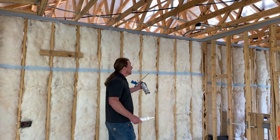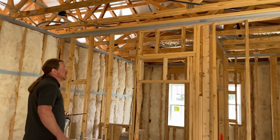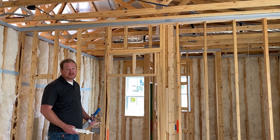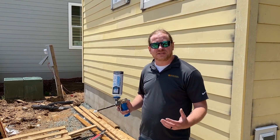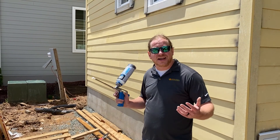The other important thing to remember is that we have to do all of our walls when we're below attic space — interior walls count too. We want to make sure that we do both sides of our interior and exterior walls for the best possible seal. Remember, when you're sealing your wall tops you've got several choices that will work, but what's important is the quality of the install. When you're talking about air sealing, it's hard to have too much foam.